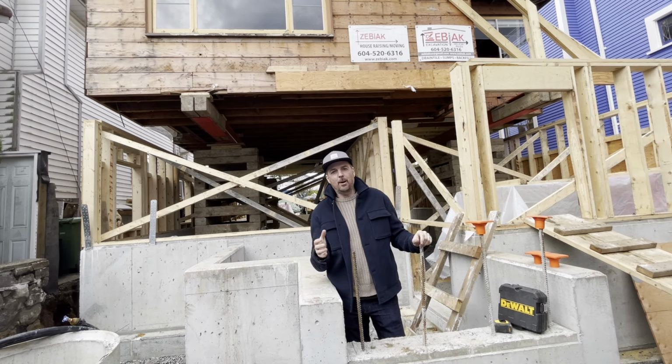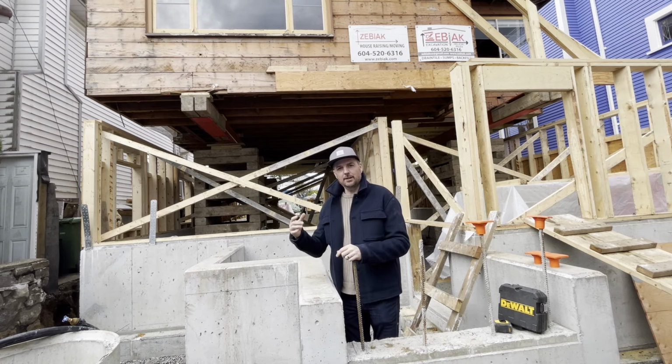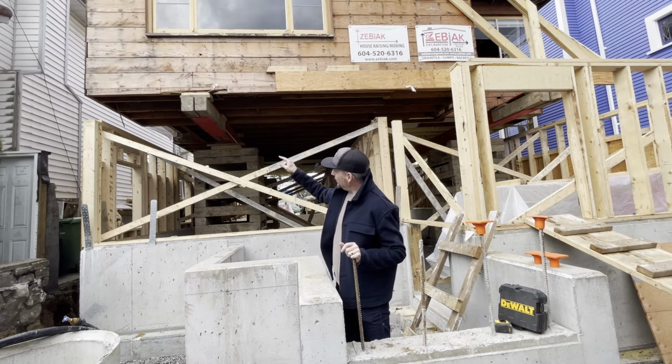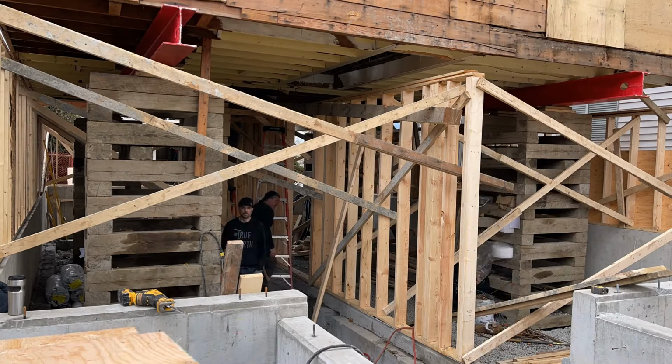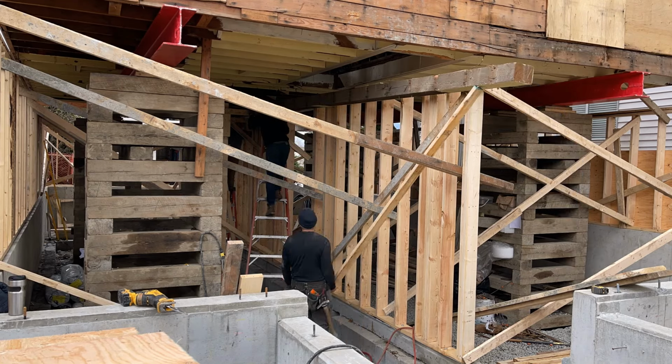One of the unique things about raising a house is that you're kind of working in reverse. You need to make sure you build your foundation and your framed walls in order to meet up with the house. We framed them with 2x6 lumber. We chose to change to 2x6 so that we had actually more bearing of the box end of the original house and the shiplap that I decided to keep on the house.